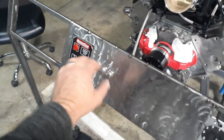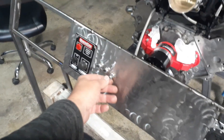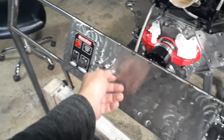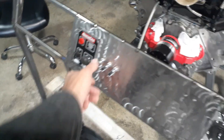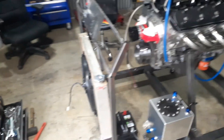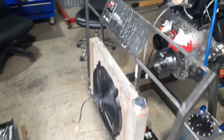I didn't find three of the same switch - this one's on, that's off, and that's on. But right now we're just gonna run it as just one single on. You gotta make sure when you're wiring this stuff up - I know this is probably obvious to a lot of you - but you gotta make sure that your wire sizes can handle the load and your switches can handle the load.